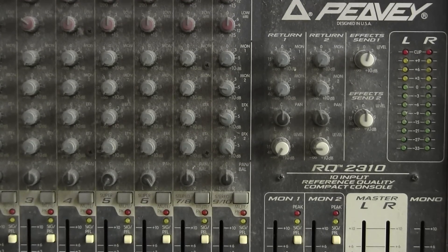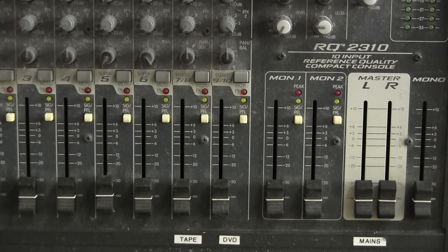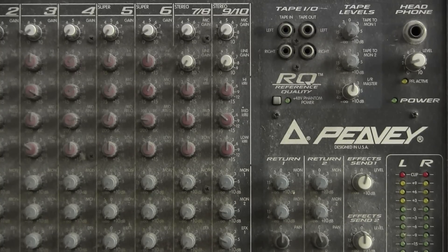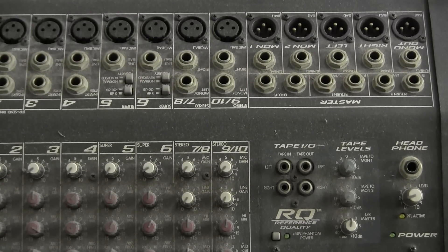This is not good for the mixer because dust attracts moisture, and if it finds its way into the slots — for example, between the faders — it can actually cause crackling or popping noises when the faders are moved. That dust and dirt deposits itself on all the contact points and can be the cause of dropouts and intermittent connections. So it's really important to keep the surface of your mixer clean, which means less chance of dust finding its way into the insides of the mixer itself.